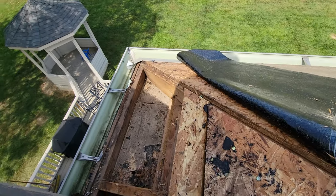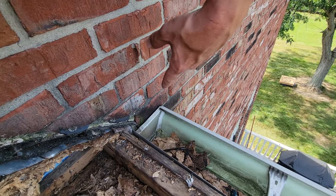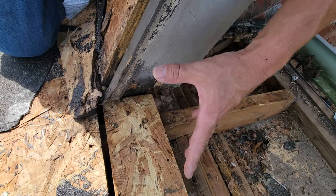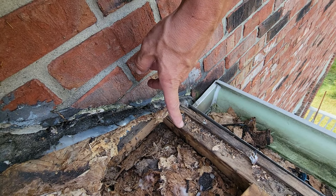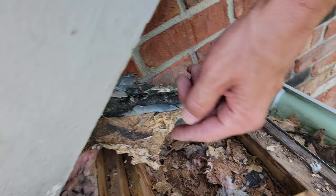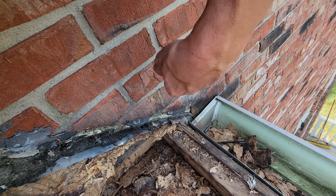There's a couple of other things right here with this brick wall. The owner noticed mildew growth over here — he's newer to the property. The remedy is there's no kickout down here, there was an excessive amount of water pouring off this area, it wasn't flashed very well and it's running out. We're going to re-flash all of this — new aluminum flashing, 4-inch high, 4-inch out, 7-inch up, shingle step, starter step, shingle step all the way up under here. The kickout will come out into the gutter, allowing water to channel into the gutter, and it's going to have counter flash all up this.